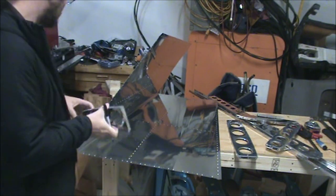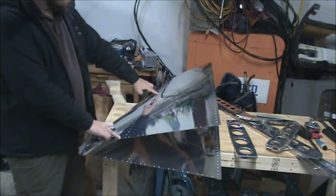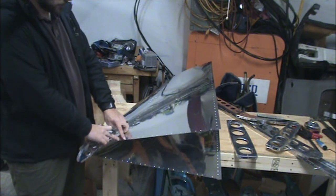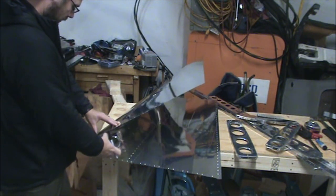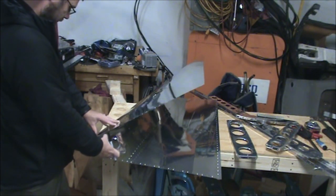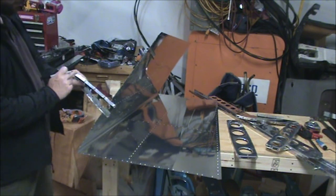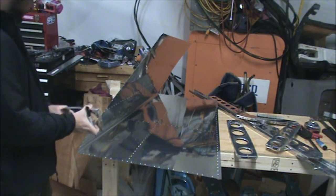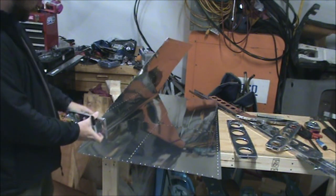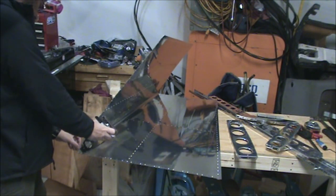And now as you go through and dimple these, make sure not to dimple the ones you circled. And it's just that lower rib set that has that problem. All the rest of the holes should get dimpled, matching up with the skins and where you dimpled them. And basically that dimple is going to allow this dimple to sit inside the dimple on the rib, so that the two pieces mesh together well, and when you rivet them, there's no real gap between the two surfaces.